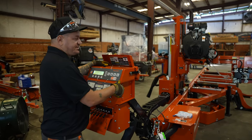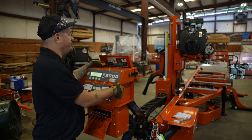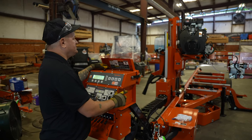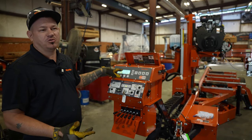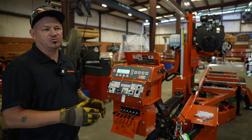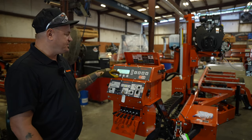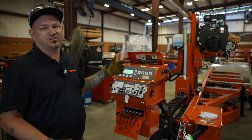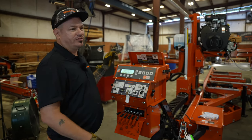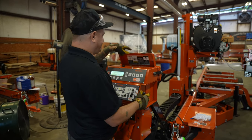Right now my blade's at 7 and 17/32 inches. I want to get it up to about 12 inches as a good reference point. I like to use 12 inches because on the calibration, this is set at 12 is 12 inches. Some people do 15, some people do 10 — you can do whatever you want. I like to keep it at 12 because when I have to program the actual height in the computer, it's at 12, so I keep it all on one setting.